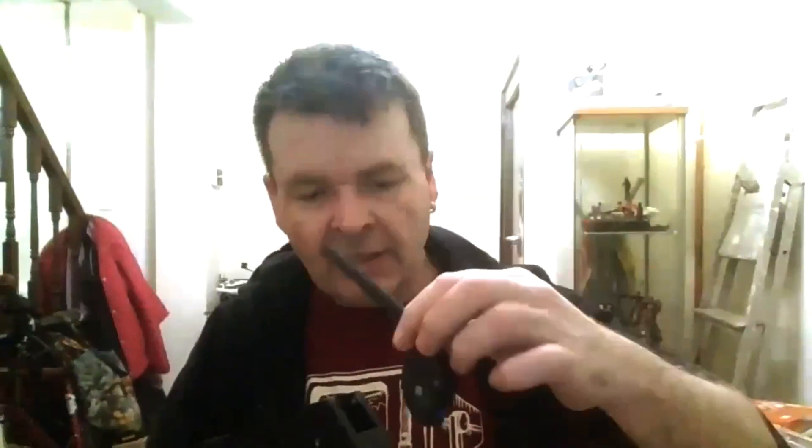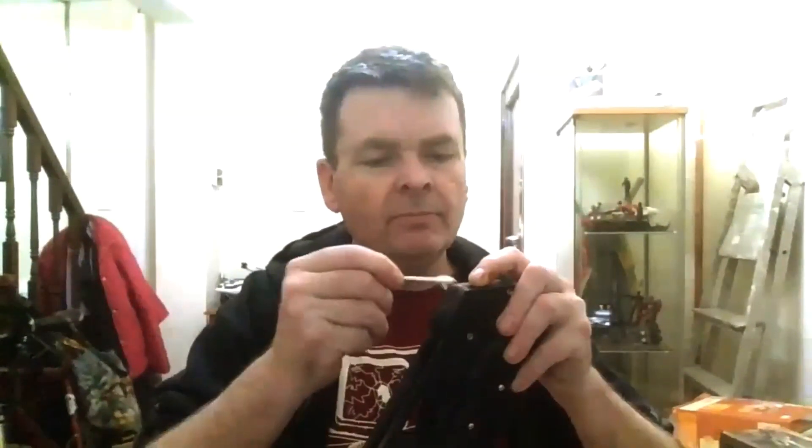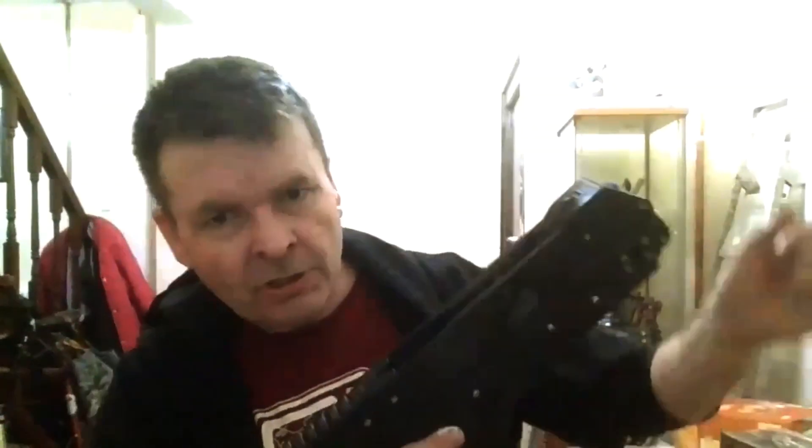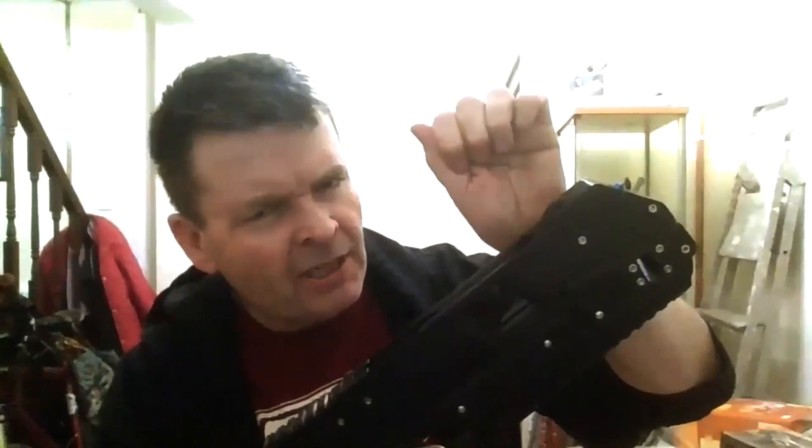Run your screw through to clear out the waste from the molding. Push it in, lock it in place, then run your screw in and put some more Vaseline in the threads — that way the pivot works freely and the thread won't bite into the plastic. Here we have it — the screw is now in place. Don't go crazy with this front screw because it's only biting into plastic. Just use a small allen key, just so you just about feel it starting to nip up, and that will do.